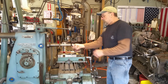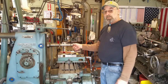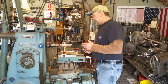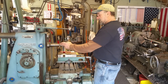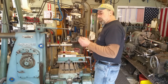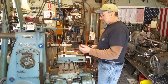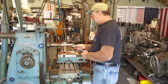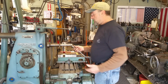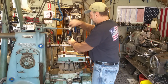All right, so we're gonna change around the mill. We're gonna get our shaft set up and let's see how it cuts. That tells the story. You look at your teeth and you cut after they've gone through a couple times. You can tell if you got one that is overbearing or overpowering the other ones, and then you can make an adjustment real quick even before you get into a full depth and into the first part in the first keyway.